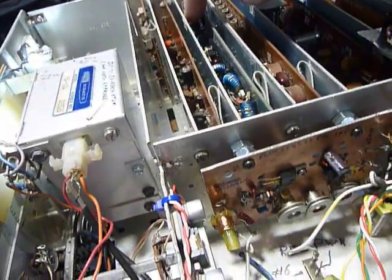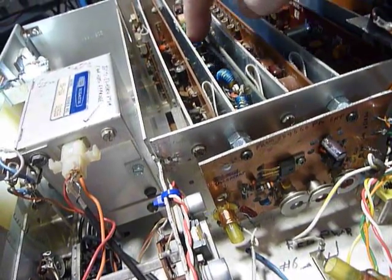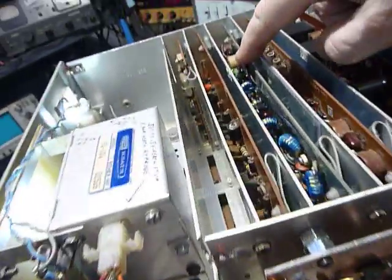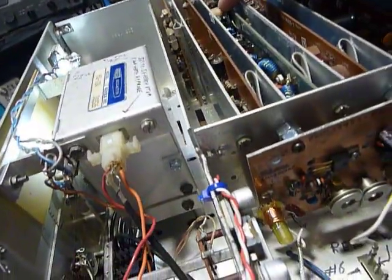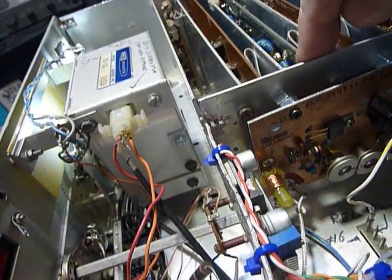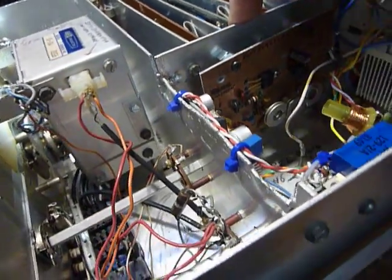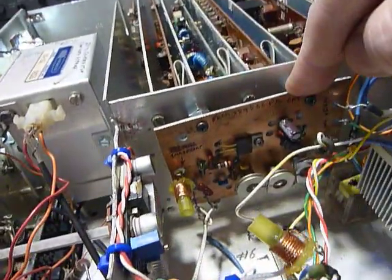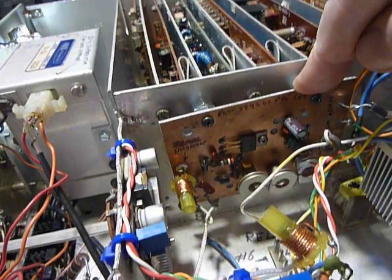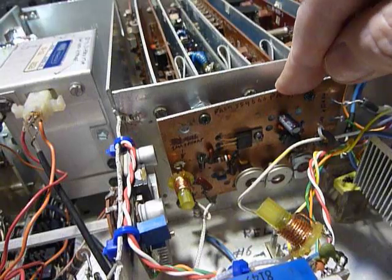Those are on the yellow cores, which are good at 50 megahertz. I think I've got 11 turns on those and little variable capacitors to tune them, and then the output of that comes out at 50 megahertz and feeds into this board here, which is the first stage of the SS 9000 power amplifier board.